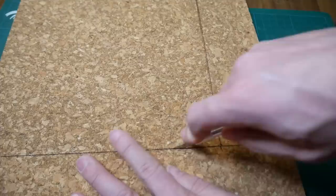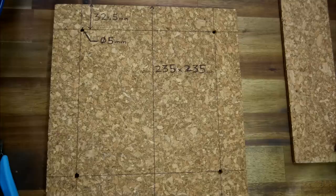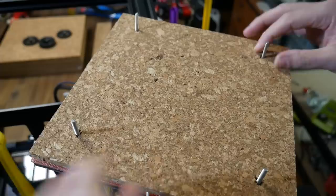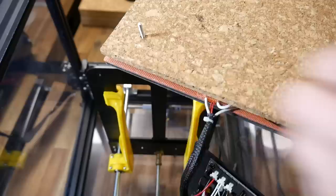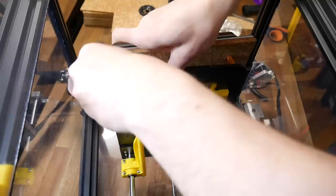These 6mm cork pieces were from the local hardware store — about $2 each and easy to cut with an exacto blade. The Ender 3 and 5 bed are both 235 by 235mm, and after cutting we still need to mark, measure, and drill screw holes for the mounting bolts. The hole should be 32.5mm in from each corner with a diameter of 5mm. With the cork prepared, it gets pressed onto the underside of the silicon heater pad. I installed some fibrous washers on each bolt, then the factory springs back in their place. I've also cable tied the wiring to the heater to hold it neatly.